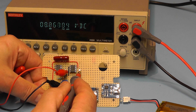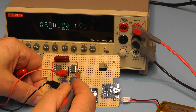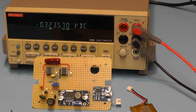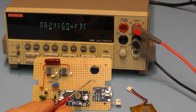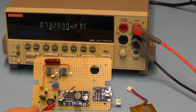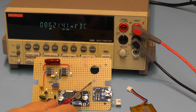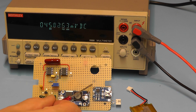Checking the 5V again - very good. So there you have more or less a finished unit with the exception of the LED circuitry and the voltage supervisor IC. It's not critical that you have that option fitted - it is just a nice addition, so you could actually leave it as it is and keep it simple. Or you could add a little bit of circuitry to monitor the voltage and give you the dual LED indicator. So what I will do next is build up the circuitry for the LED and the voltage supervisor chip.